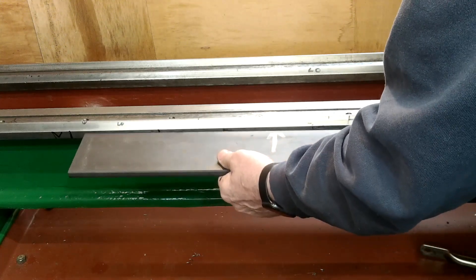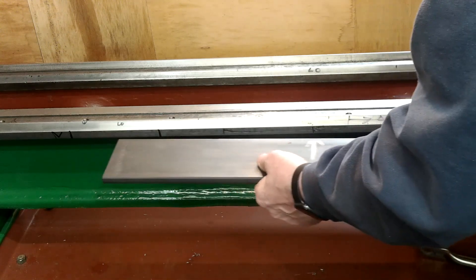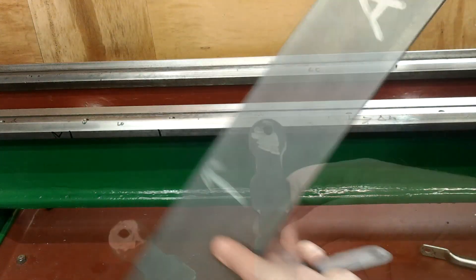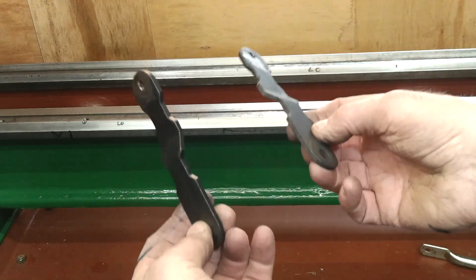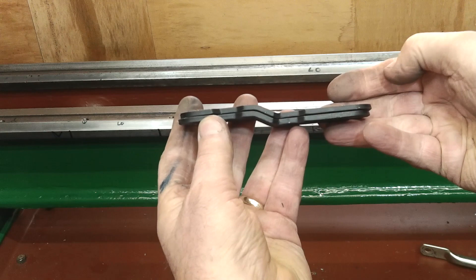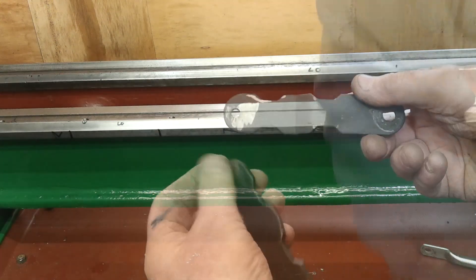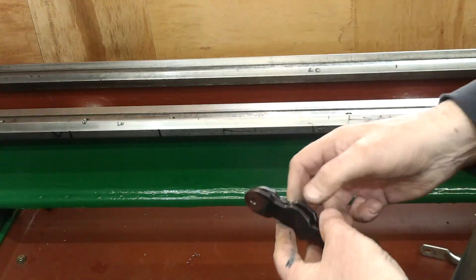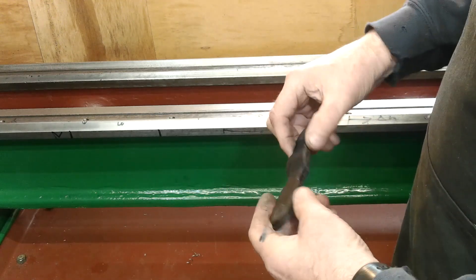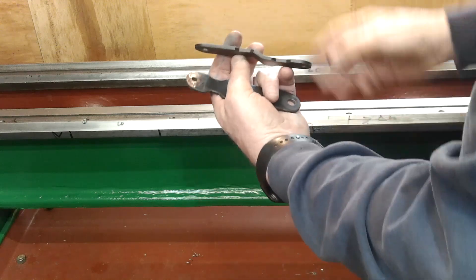To do this I'll need to use my homemade straight edge, but this will prove difficult if I can't get a constant result with regard to squareness. For this I have a number of swan-necked brackets that I rescued from a number of old chairs. I need to remind you I've got to support the straight edge in the same position every time I take a measurement, and these bits of old chair bracketry will, when bolted to the front underside, provide enough support for the straight edge.